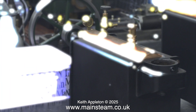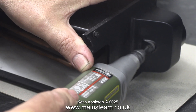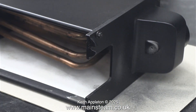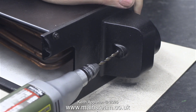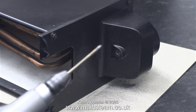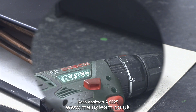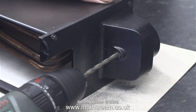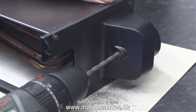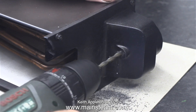What follows are edited highlights of the second 501 boiler. The process is exactly the same as you've just seen so I'm not going to labour it. Everything's running at a higher speed and in no time at all I'm going through with the 1/8th of an inch diameter drill. And finally, as before, I use my Bosch drill with the 3/16ths of an inch diameter twist drill, which makes short work of enlarging the hole. Once again after doing this part of the job I remove all the chippings, because there are quite a lot now on the piece of cardboard.